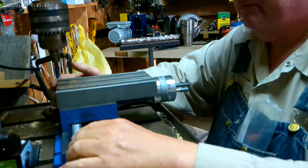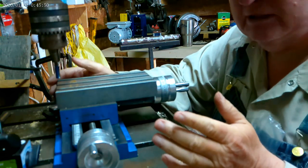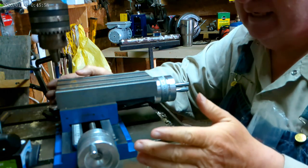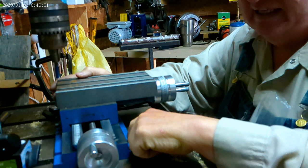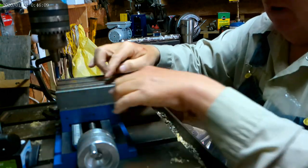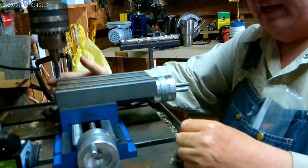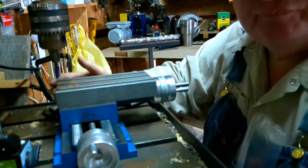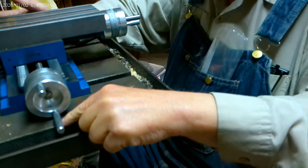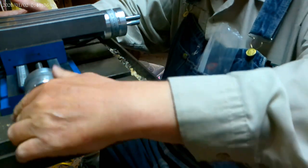This one matches with this table real good, so when I'm using this as a milling machine I have the full run. This only moves three inches — it moves three inches in the X direction and three inches in the Y direction. What I have done is set this up so I will fasten it to my table with the corner over here under the bit, giving me three inches of travel in that direction and three inches back.